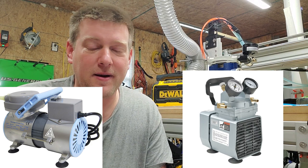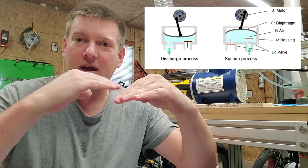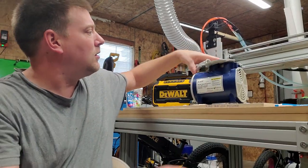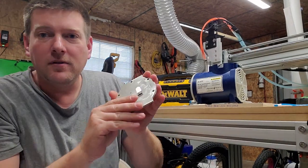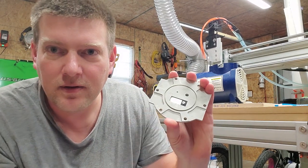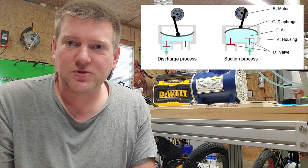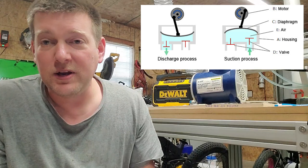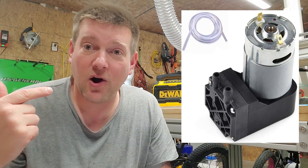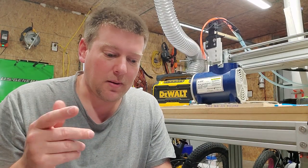The first type is going to be your diaphragm pumps. These are the ones that have a little rubber disc that will flex in and out, and it's got two little reed valves that go up and down. A reed valve is a little flapper — a little piece of metal. You can see there's a reed valve right there, and there's one on the back. Those are called flapper valves or reed valves. Diaphragm pumps will have a rubber disc that pushes in and out, and the little reed valves control the airflow in and out of the chamber. They're cheap to produce and based on RPM of the motor — the higher the RPM, the higher vacuum you're able to pull.